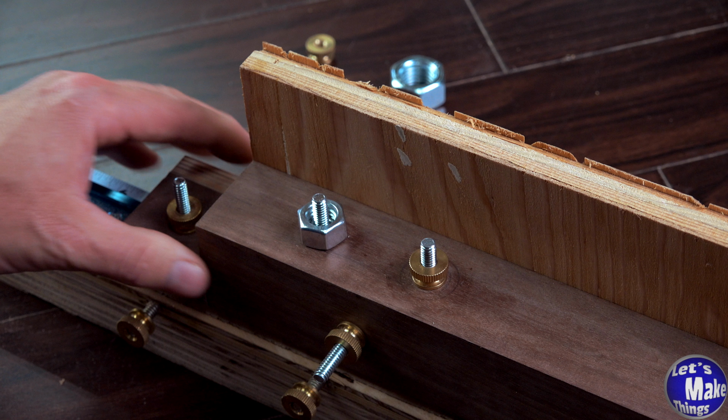The same is true on the opposite side, but I think you're gonna have to play with some numbers a little bit because a lot of these nuts are not exactly the same size. And again, you might have problems with the other sizes, but I thought we'd take the extreme case here, which is the 1/2 inch, and see how well it goes into a 7/8. In this situation, you'll probably have the most stress as far as pressure to push this in. I definitely would not try this with my vise. I don't think that I have the power to do it with that. I think I'd probably crack it. So let's go ahead and take it back over, see if we can hammer it in.